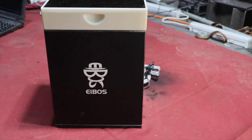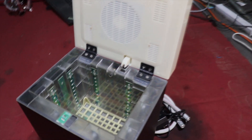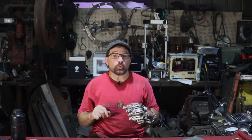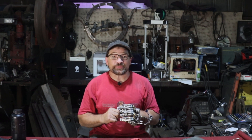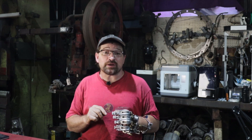Finally, I'd like to show you a pretty cool product that showed up at the shop the other day. This is the iBoss Post Processor — it's like a dishwasher for your resin printed parts. After you finish printing, you remove the parts from the build platform and place them in the basket of the parts washer. Next, select the height of the IPA, the wash, the dry, and the cure time you want for post-processing, and press start. The IPA gets transferred into and out of the washer a couple times, and pretty soon it stops. It definitely beats swirling your parts around in a mason jar of IPA and then sticking them in the sun for post-cure.